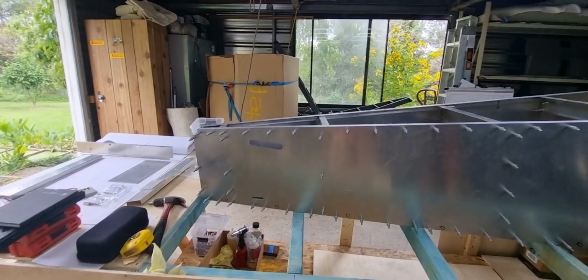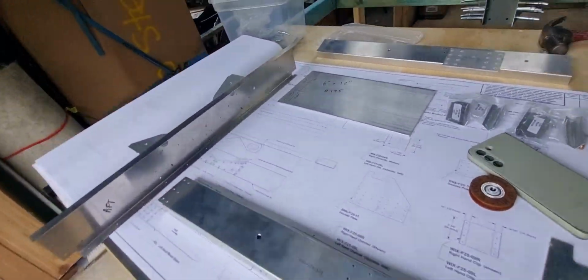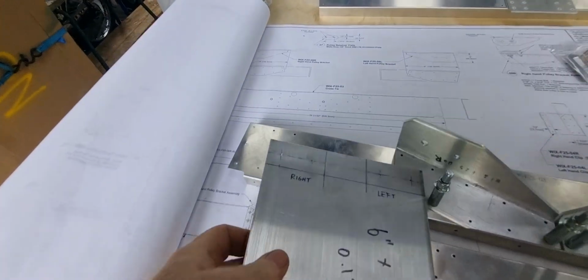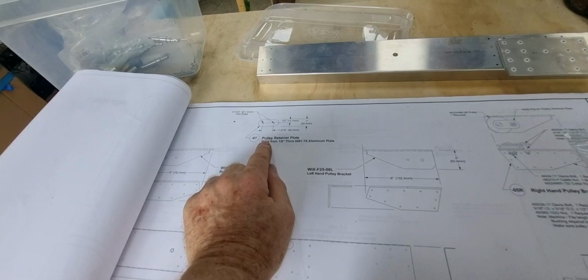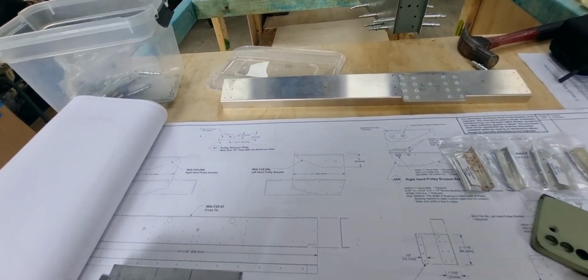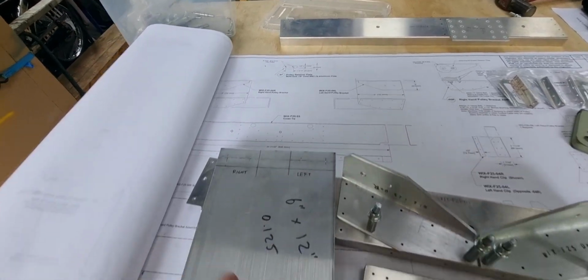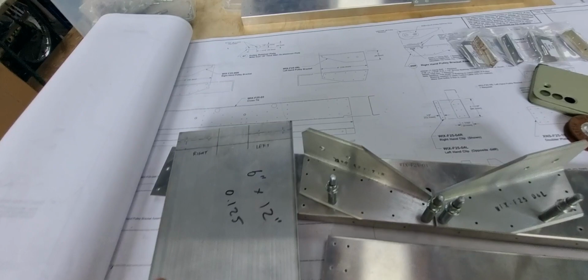So anyway, I'm going to proceed on and build these little tiny pulleys into here. I will be cutting some little pulley retainer plates out of the stock materials supplied in the kits. That's the 1/8 stuff there, I hope. I've converted it from the decimal back to 1/8, 0.125 is 1/8. I've measured it every way, shape or form, so I'm pretty sure that's right.